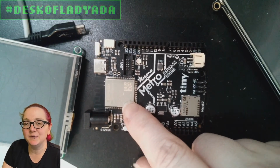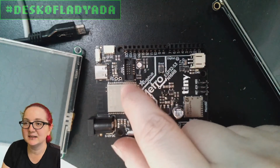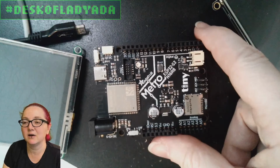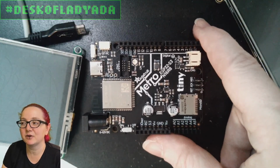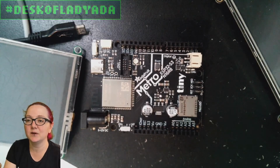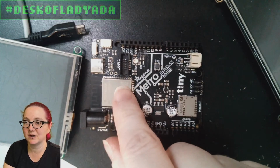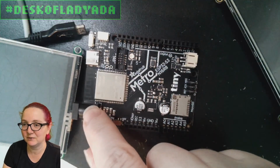I had enabled the PSRAM, and the PSRAM was like, yes, I'm running and I'm detected. Later, in the test program, I'd have it connect to the SD card. And the test passed because after the PSRAM was initialized, I never used it. I tested to see if I could communicate with it, and the PSRAM said yes. Then I never talked to the PSRAM after I configured it for the SD card, so I didn't realize those pins were unavailable.